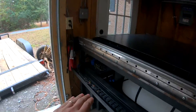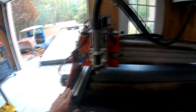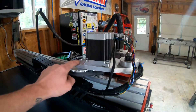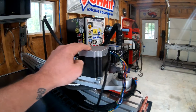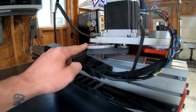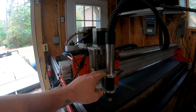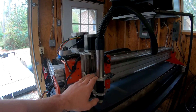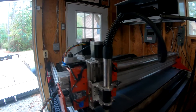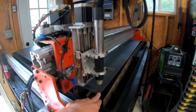Starting on the left, underneath the rail you can see the electronics enclosure built in the corner. You can see the two Y-axis pieces of extruded aluminum, and then the X-axis up here. This gives you a good shot of those Avid CNC gear reduction drives — they fit a NEMA 34 motor perfectly and bolt right into the aluminum. My Z-axis uses a cheap plasma Z-axis from eBay that my torch bolts right into. I do use a machine torch, which I prefer over hand torches — worth a couple hundred dollars in my mind. The Z-axis does have a float switch, so the machine does automatic height sensing based on the material on the table.